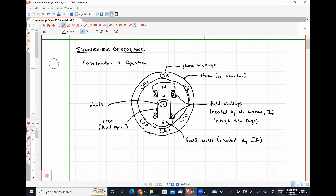The synchronous generator and also the synchronous motor is a doubly excited system. That means there is external excitation on the stator and excitation on the rotor. In the induction motor, we had single excitation because we applied outside voltages to just the stator and then the rotor developed its own voltages and currents through mutual induction. For a synchronous machine, regardless of whether it's a generator or a motor, we are supplying external power to both the stator and the rotor.